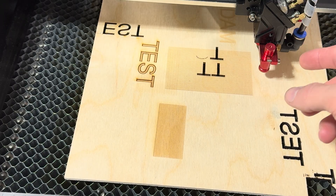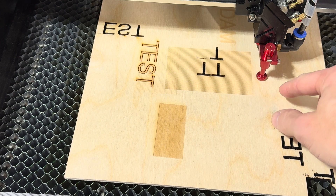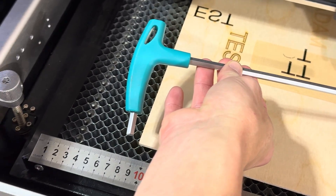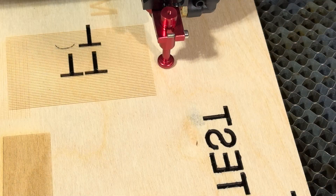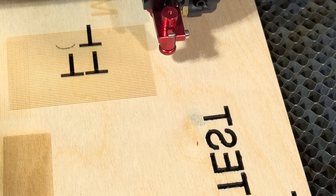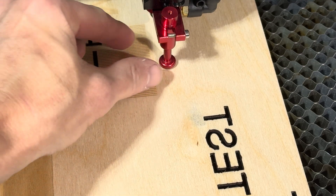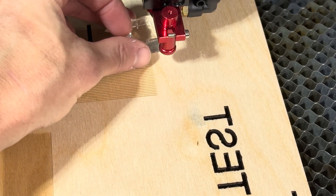Next, preparing your work piece — you want to focus your laser head. There's a pull-down piece that should just barely kiss whatever work piece you have underneath. The whole bed raises up and down using four jack screws, and the included tool lets you turn and raise it until the little tab just barely pops back up. If you're unsure about the height, there's a little acrylic block you can slide under your laser head as a checker to make sure you've got the head just right.